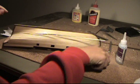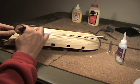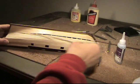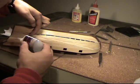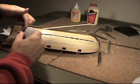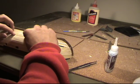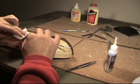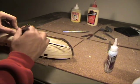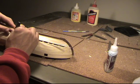This is that very last plank that I was talking about that had to fit in exactly like the last piece in a puzzle there. And it was very interesting the shape that I ended up with on this plank so that it fit in exact. And it was also interesting to compare the last plank on this side with the last plank on the opposite side of the hull here to see how different they were or how similar, and to see if they matched closely, which they actually did on this particular one. Although we're using the spiling technique on this last plank, I actually had to use a little bit of trial and error. And it probably took the longest out of all of the planks that I worked on as far as this first layer goes, but a little bit of trial and error, and it fit in there perfectly.